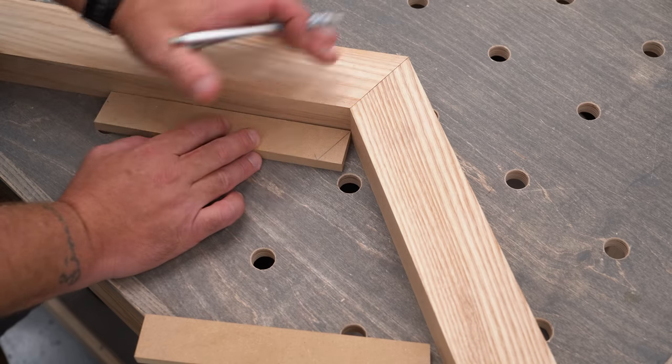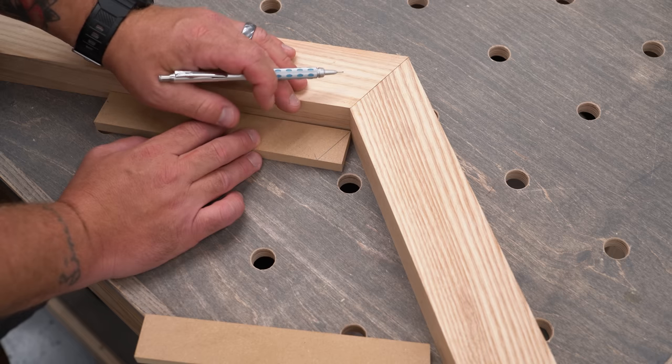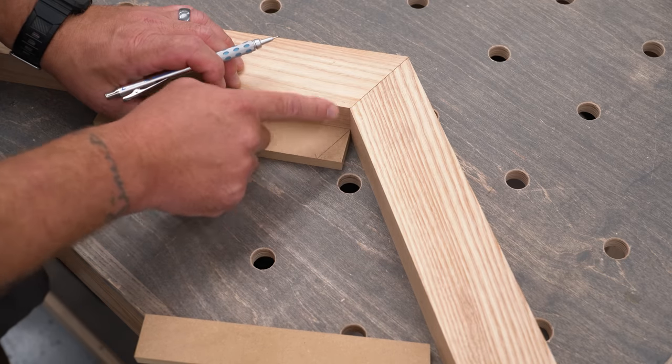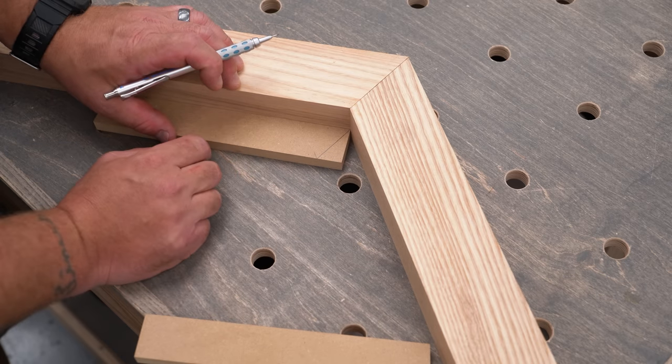that is what I need to cut that angle to. Now of course it depends on how meticulous you are with drawing this out and how meticulous you want the job to be done, but this is all you need to do to figure out those two pieces. Cut both your pieces at whatever this angle is — it doesn't matter the number — and it's going to fit every single time.